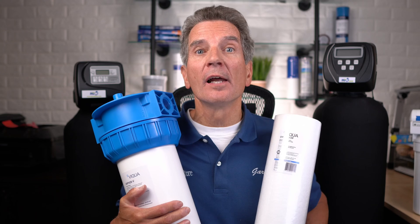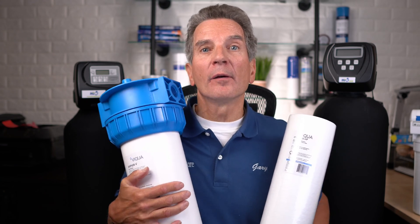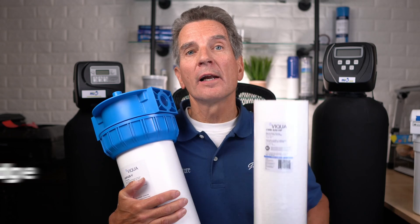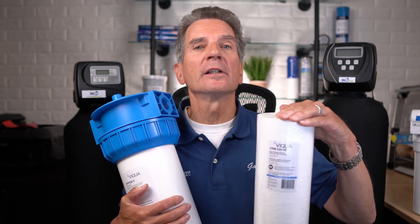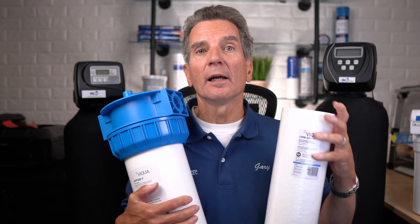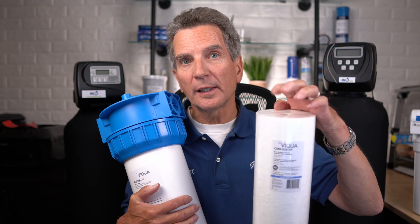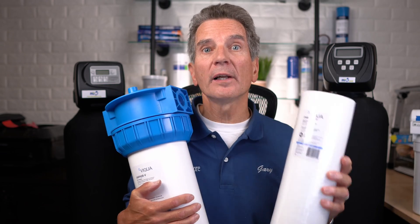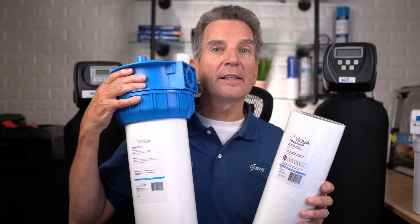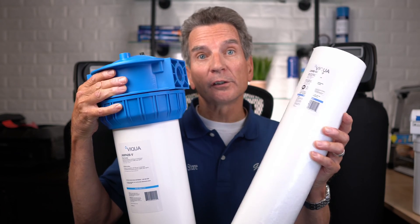Normally city or municipal water systems don't have a lot of dirt or sediment in them, but if yours does, the best place to start would be with a sediment cartridge filter like this one here. The polypropylene filters come in different grades, densities, or micron ratings. You can even get dual gradient sediment filters with a coarse 20-micron filter on the outside and a 5-micron filter in the middle for long filter life. The filter goes into a housing like this one, and you'd need to change the cartridge once it gets dirty.